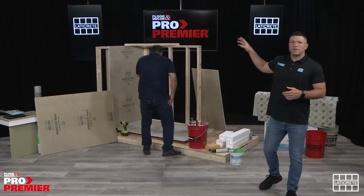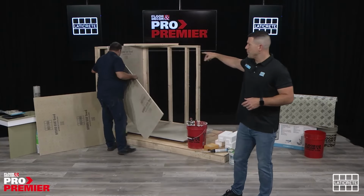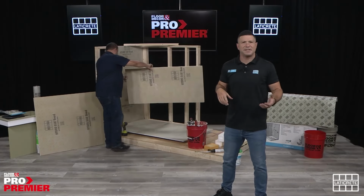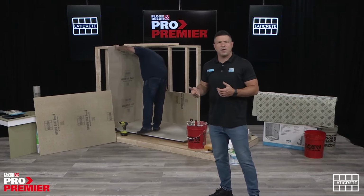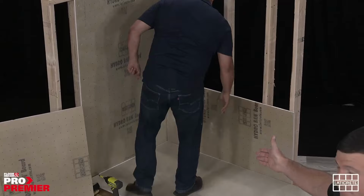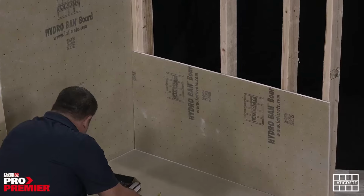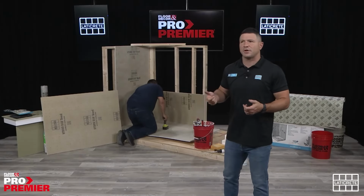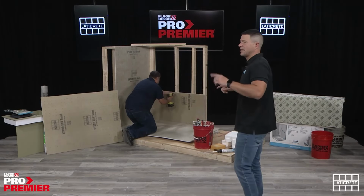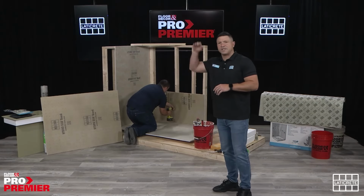So we have one of the walls up. We did it in two ways because we wanted to show you both options. We have it vertically, and then we're going to put two boards up horizontally. Again, depending on the job site conditions or the dimensions of the installation area, we have the ability to stack boards like Adrian's doing. We cut those to make sure it would fit within this framing. So you could do it both vertically and horizontally. Obviously, when you're doing it horizontally and vertically and you're using multiple boards, you're going to have to treat that seam. And that's kind of what we're going to show you a little bit later on, like I've been alluding to. So for the sake of this one, he's going to stack two of the 3x5s horizontally, one on top of the other.